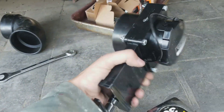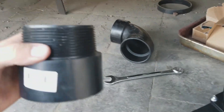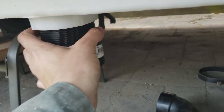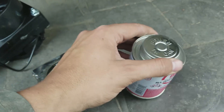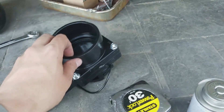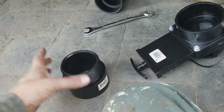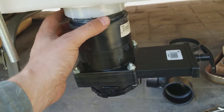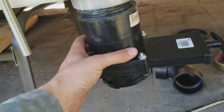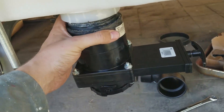Now is a good time to install my dump valve for my gray water tank. It's a 3-inch ABS fitting, but the tank itself has a threaded fitting. So this guy will need to be glued in there. To do that I have some all-purpose glue right here — this is for joining materials that are not alike to each other. This is polyethylene and this is ABS, so in order to glue them together I needed an all-purpose glue. For the rest of the setup I have just normal ABS glue. But I'm going to go ahead and put some glue on this thread, pop this adapter in, and then continue my ABS assembly from there. The all-purpose glue set incredibly fast, so I was racing to try to get it in there as far as possible before it couldn't move anymore — and it's in there.